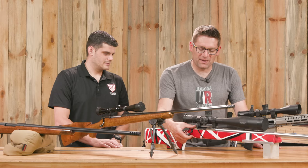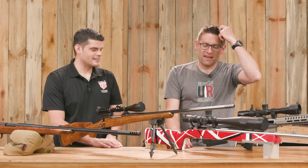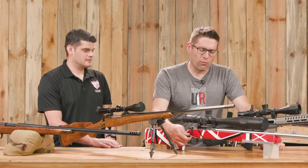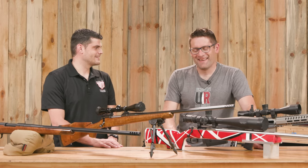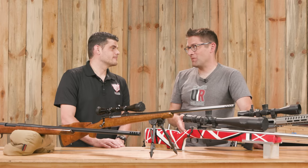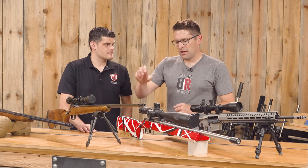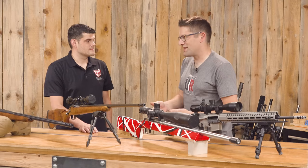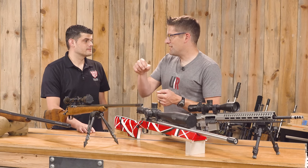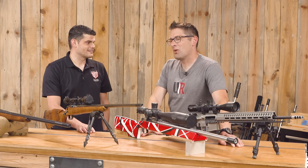After I was completely done, the caulking piece chipped away the paint — I didn't clearance for that, so I need to mill that out a little and do a white touch-up. One thing that went well, after an initial mess-up: I went to do the bedding with Devcon — a suggestion from the Bat Machine guys because it doesn't shrink much. I ran out of material mid-pour and my scale died. They had me use a heat gun to tease all the bubbles to the top, squish it down and overflow. It actually worked out perfectly in the end.